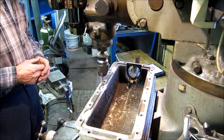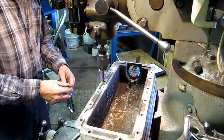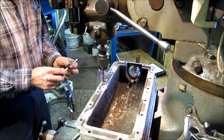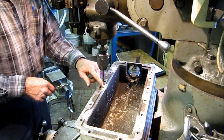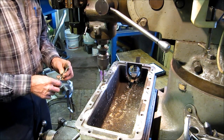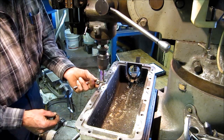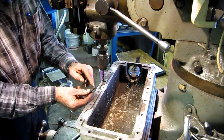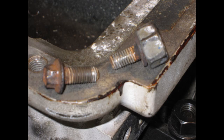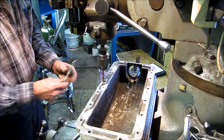The helicoil comes with a 21/64 drill bit. What we're doing here is we went in with one of our crash bits — one of our sacrifice tools, as I like to call it — because we have the remnants of that bolt in there and we know there's a bunch of trash, corrosion, and rust around the outside of that bolt. We pulled that one out; that's the one with the welded nut on it. Here's the one we actually got — you can see galling on the end of the threads, rust and everything else in there. I just like to keep a good bit in reserve; we'll come in with that after we actually have all the crap out of the hole.